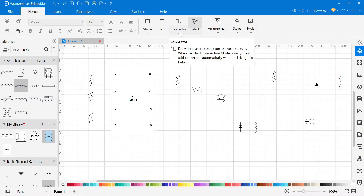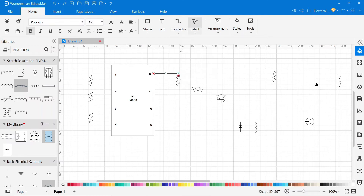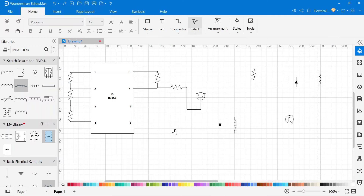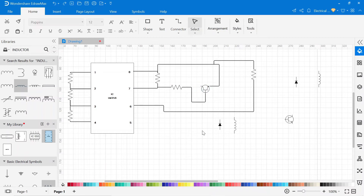To make a connection, go to the connector and select the connector according to the circuit diagram. After that, simply draw all connections as per the circuit diagram. Here, pin 2 and pin 3 are input pins of this IC. Through these pins, it detects the temperature. Pin 7 and pin 6 are output pins that will turn on or turn off the transistors.